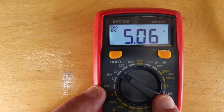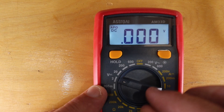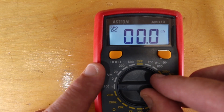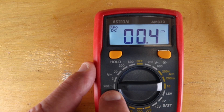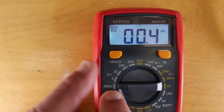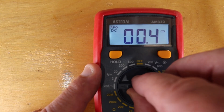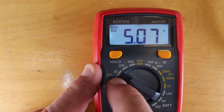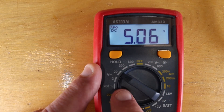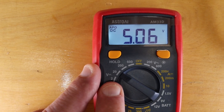That's true for all other ranges — resistance, AC voltage, and current. Always start at the high range and come down until you know what the voltage is. If you start too low, it'll be overload, or worse, you'll get a misleading reading. For example, on the 200-millivolt range it suggests a very strange voltage which isn't true. At 2 volts it's overload, and at 20 volts you get the actual measurement. Start high and crawl down until you reach the point where the next range down wouldn't have enough range.